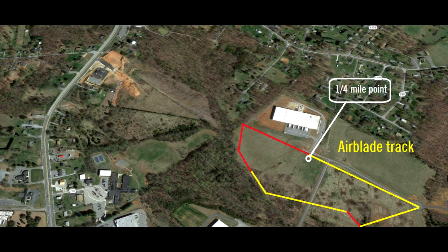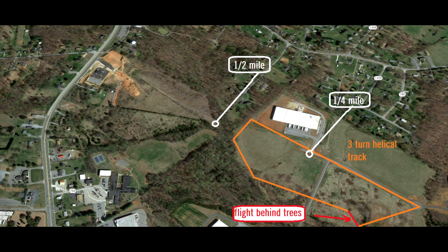This is a map overview of the Airblade performance. The area in yellow is where the Airblade performed well enough to race, and the area in red is where the signal was not good enough. In the lower right hand corner where I violated the Fresnel zone, the area is red despite being close. Moving to the helical flight map in orange — very similar to the Airblade flight map. The only place where the signal really wasn't usable for racing is in the lower right hand corner where I flew behind the row of trees. Overall, it's obvious that the helical works better when flying from the corner of your field for mini quad racing.